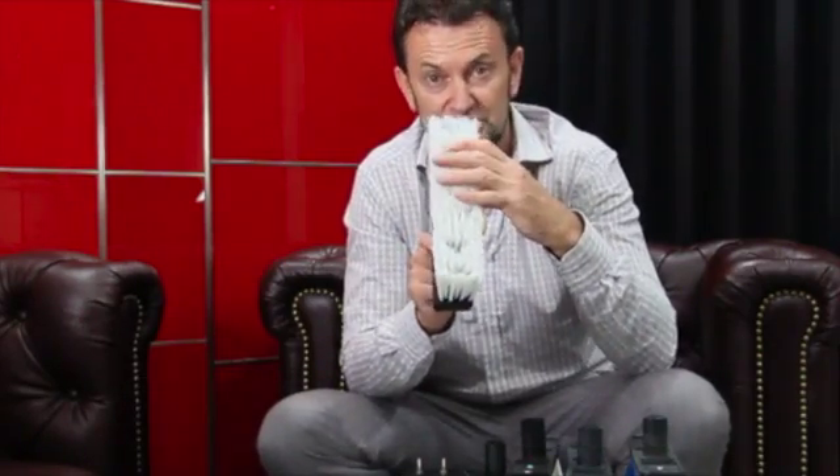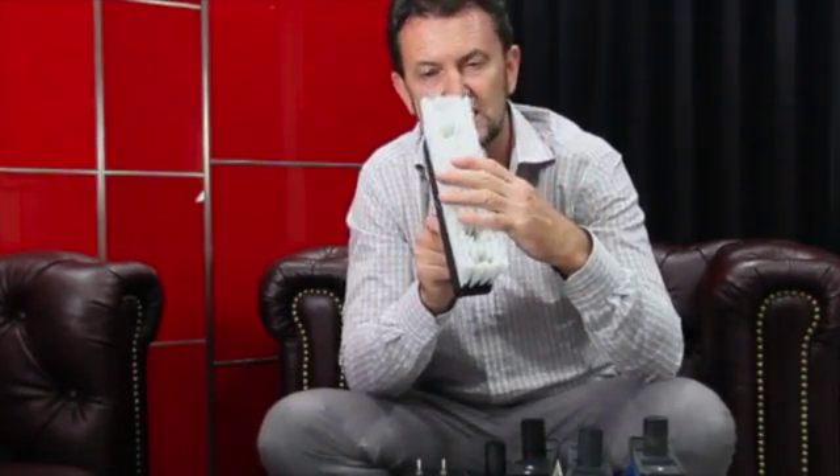If you're wanting to clean at 5 or 6 storeys and you want to leave the brush on the glass, you can see in close up that the density of bristles is much less. That means the firmer bristle brush has much more capability of self-cleansing, allowing the water to wash the dirt out through the brush. So you won't have to take the brush off the glass to do the rinse that we recommend when working at lower heights.